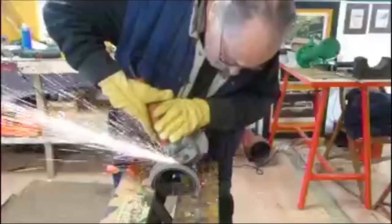Okay, you're probably wondering why in the world he's grinding on a main bearing. Well, I couldn't find him the last crank bearing that he needed, but I could get another thrust crank bearing. So as I was looking at it, I just thought, you know what? If you just cut the thrust ears off of this, it's identical to the regular bearing. So I told him that was our only option, and I went ahead and sent it to him, and this is him cutting her off.